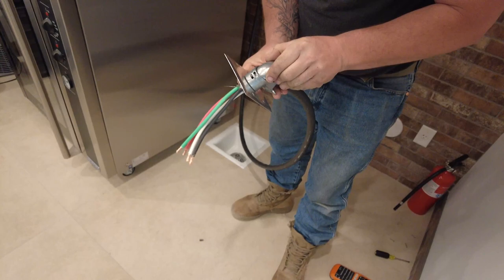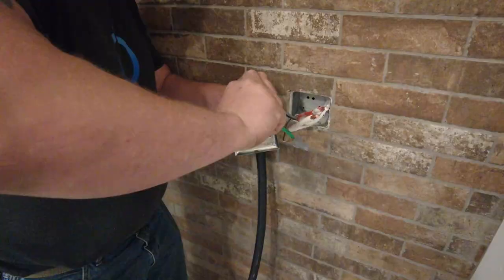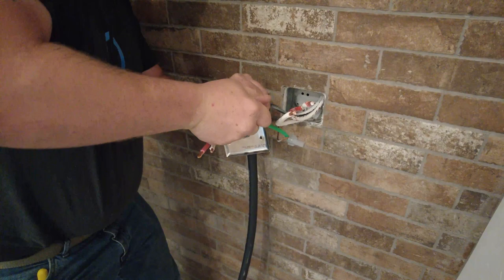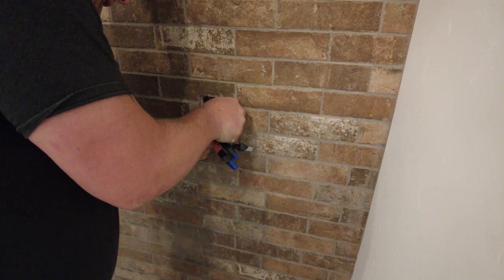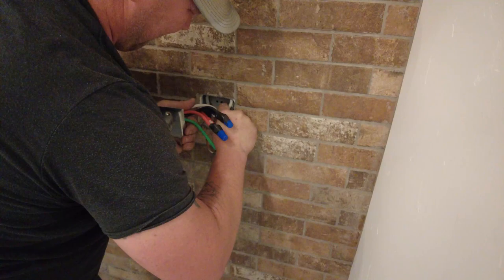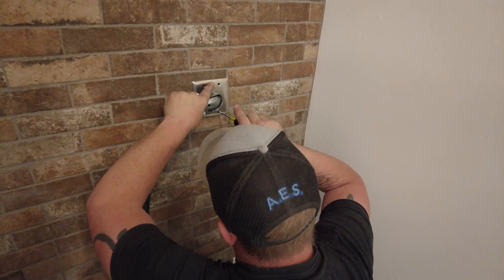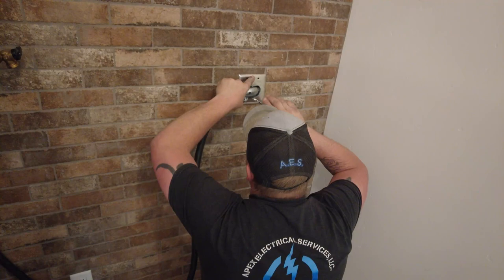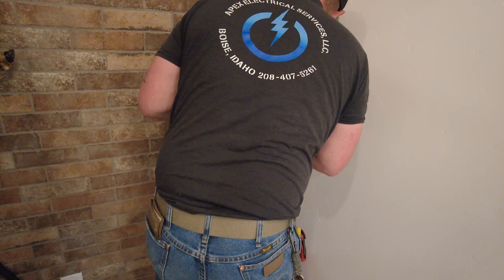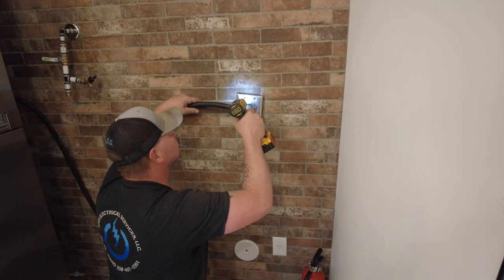Wire nuts are done by size and go by color — blues will be bigger. It's hard getting the big wire into them; it doesn't like to bend well. You'll have to use your muscles — one wire at a time, get your back into it. You don't want to push too hard or you'll push the box out. You always want the wire coming out horizontal or vertical — going upward so that it doesn't get trapped on the wheels or underneath.